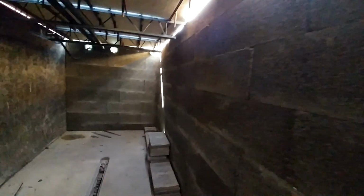Oh, and I can give you a quick update on this too. Look at this. I'm going to fill this with nice stone, and this is basically my moisture trap. If the cold storage isn't producing enough moisture, the moisture from the ground will come up into the space, or I can add a little bit of water that will evaporate. We're going to leave the Durisol exposed. I've done that many times in the past. I'll probably just use a belt sander or something like that to clean off a few things. And on the old concrete wall, we've cut the faces off of the extra blocks, and we're going to glue those blocks onto this wall, so it's going to look like a seamless finish on the inside.